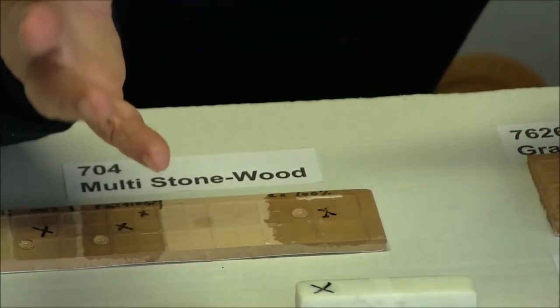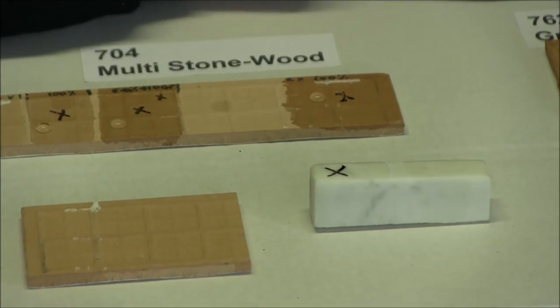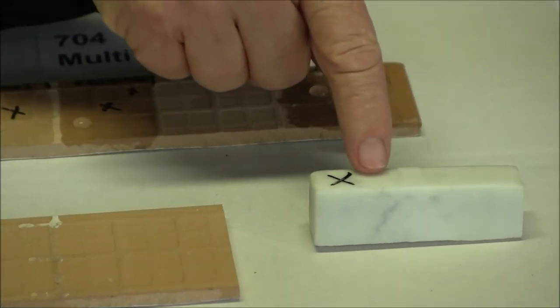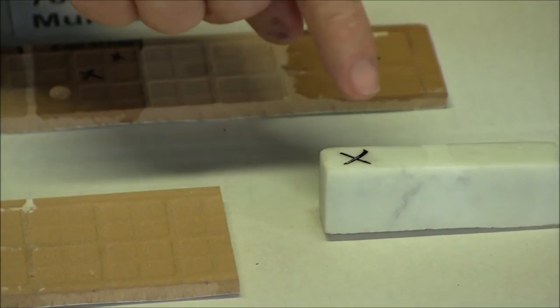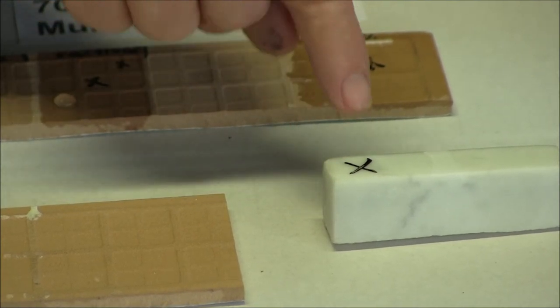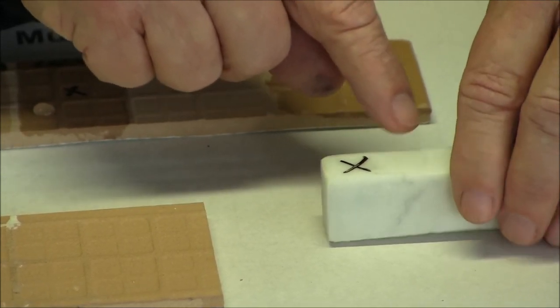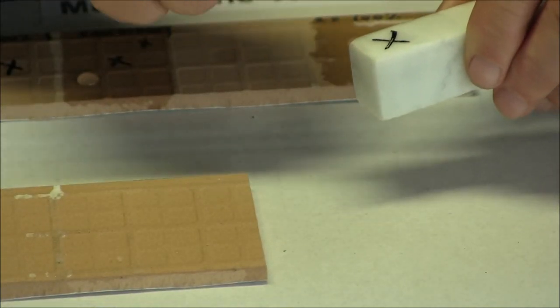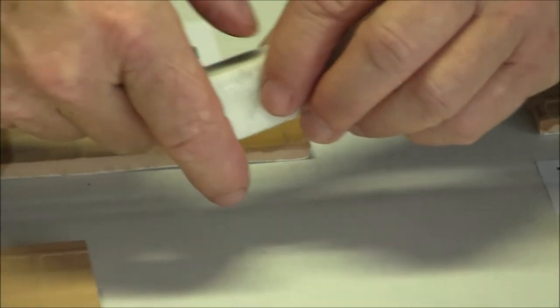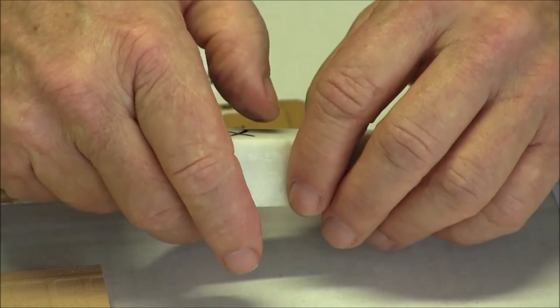So, what are the strengths, what are the weaknesses on marble? The strength is, it will protect the marble against any staining. That has to be great. So it's going to protect the marble against all staining, red wine, olive oil, lemon juice, brilliant. When it's in 100%. The downside is that when you put it onto these surfaces, even if I put 50% as a primer, it doesn't absorb as readily. And so if I scratch this surface with a sharp implement, I'm going to scratch it through and I'll actually take off the top.